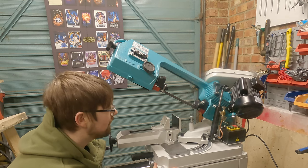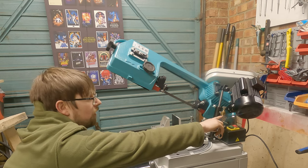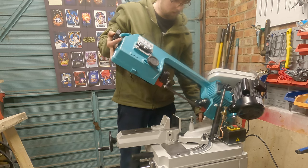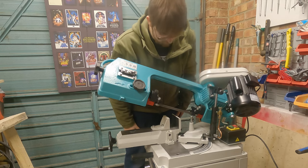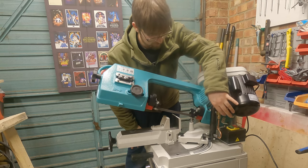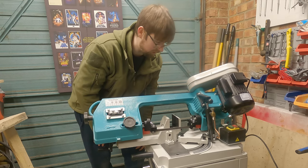We're going to fire this up and see how noisy it is. Well, that's pretty quiet indeed. A few other features — one reason I wanted this style of bandsaw is it's got this hydraulic ram which you can adjust the fluid flow on, and that basically controls how quickly or slowly the blade comes down. All the way wound in means almost no movement; as you unwind it, it creeps down ever so slightly, then faster and faster. So that controls how vigorous a cut you're doing — pretty cool.